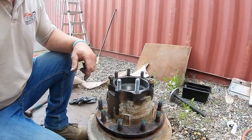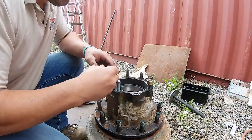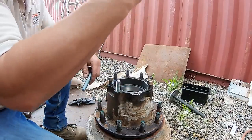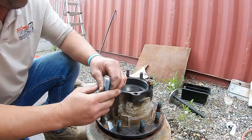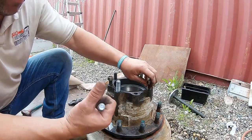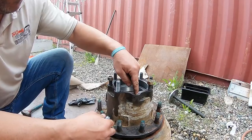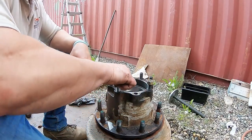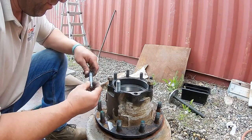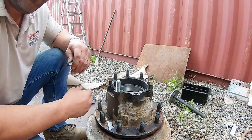But yeah, normally in a perfect world, if that bolt wasn't down in an inch and I wasn't pushing for time, that welding trick always works. I was disappointed I couldn't show you guys that because I do that all the time on manifold bolts or any kind of stud. If that was flush, you just weld the nut on it, let it cool off and it will pull out. And if I had enough time, I probably could have got those, but again, I don't have the time, and save it to the professionals that do that every day.